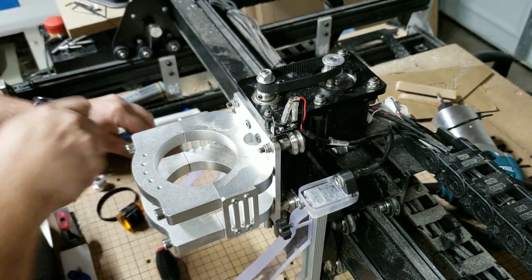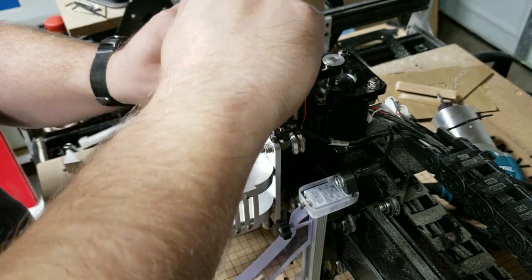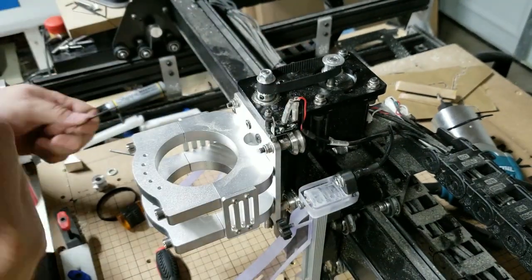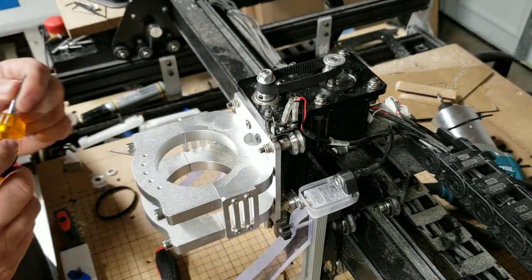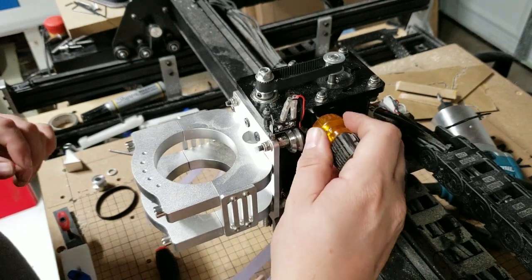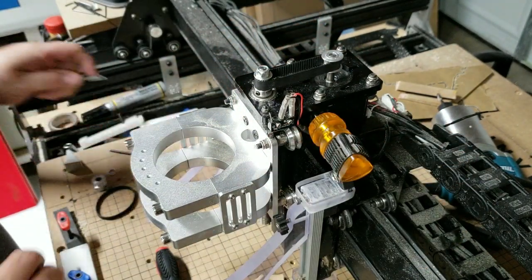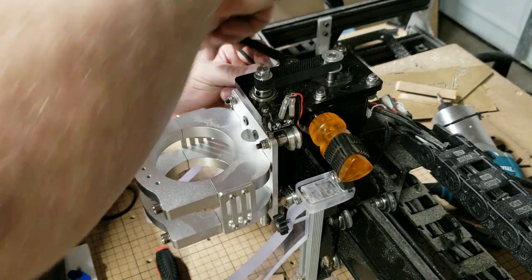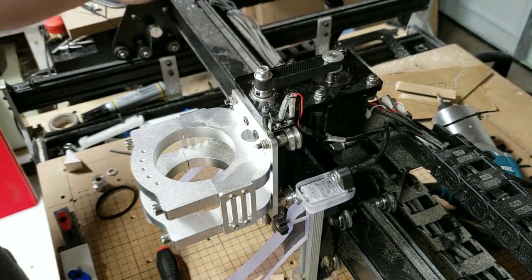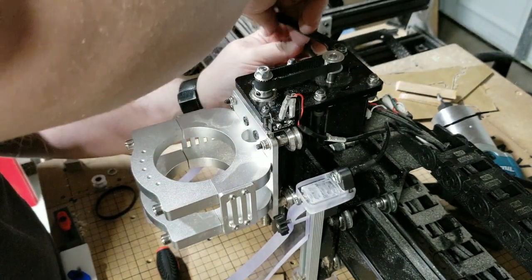We've got our 2mm Allen. I've already tightened these up — make sure they're nice and tight. You can use Loctite on them if you want to. I haven't had a problem because these are M4; I find that less problematic than the M3 that comes in the original pulley. Now what I like to do is use a flathead screwdriver — just gently, you don't want to force it, but just enough to hold tension on there. Sometimes you can get lucky and wedge it. You want to tighten one fastener down, then pull this out and it should still have good belt tension. Then go back and tighten the rest of them down.